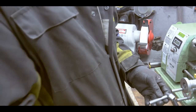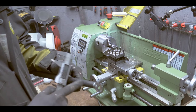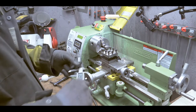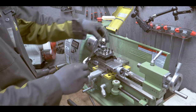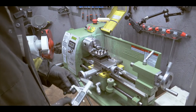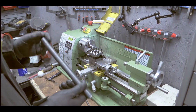Next step — we need to make the nut body. Diameter is almost irrelevant, around 20mm. Height is 26, but we can actually make it 30 — why not? That way, even if it's going to be at a different angle, it'll still be slightly higher and not touching. So we're making it 30mm. There aren't really that many measurements, so we can just do it free-handed. Love the free-handed!